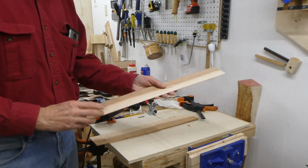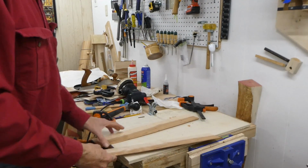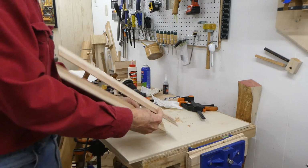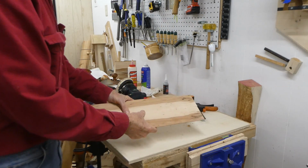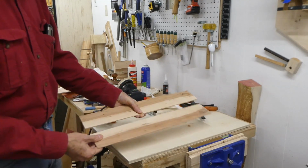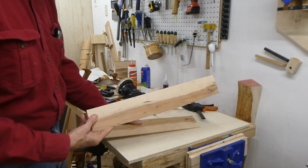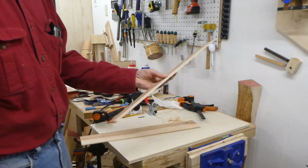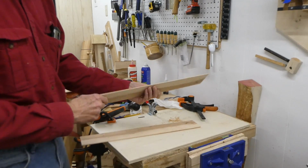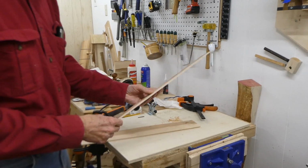Each ukulele gets two sides, and the sides are book matched. They're cut from adjacent pieces of the same log, and then they get thicknessed to about 1.8 millimeters. So far, this is down to 2 millimeters now, so I've got another 2/10 of a millimeter to finish off